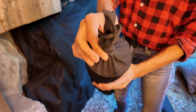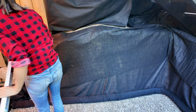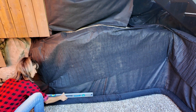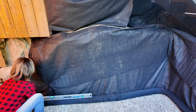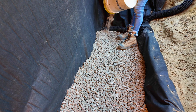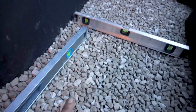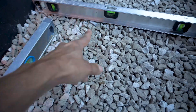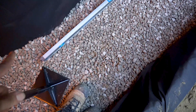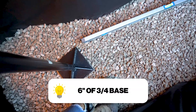Let's tie this up. You wanna get a level on that and check. Make sure that one side of your drain line is slightly higher than the other so it can actually drain. You have to remember to have proper grading. Once you have your drain installed, check that you're level across the width of your trench and along the length. This all has to be level — six inches of aggregate, thanks to this right here.